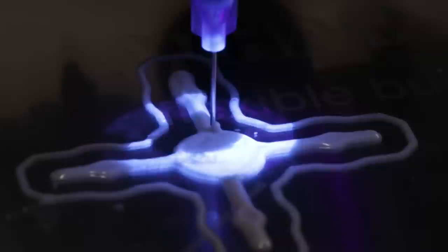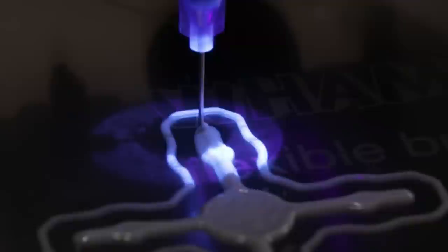Printing midair. This process turns out to be very tricky. If at any point of the print the nozzle doesn't come in contact with the print, then a drop will start. Unlike standard 3D printing, it's not able to recover from that. This is the best I could get. I also tried with the high viscosity resin. I made some art. I was thinking of ending this video.